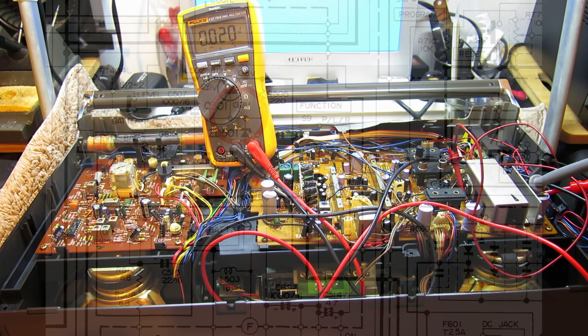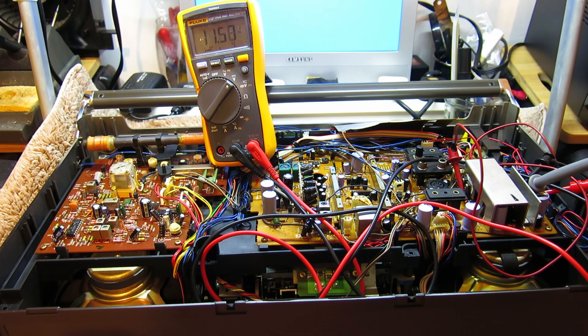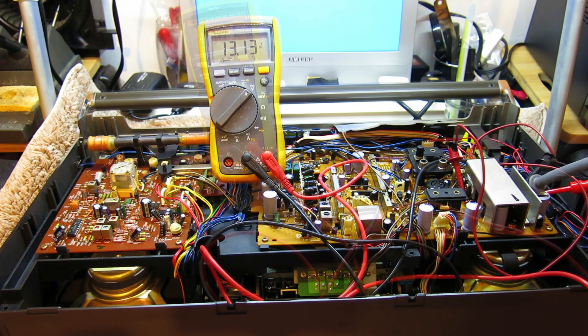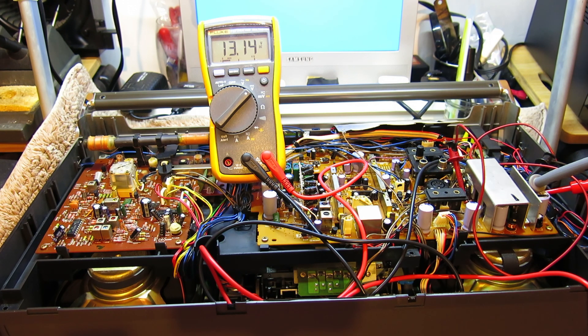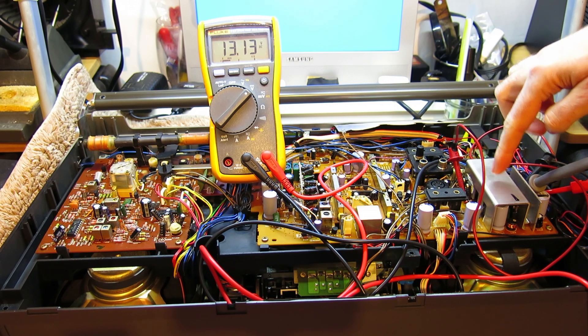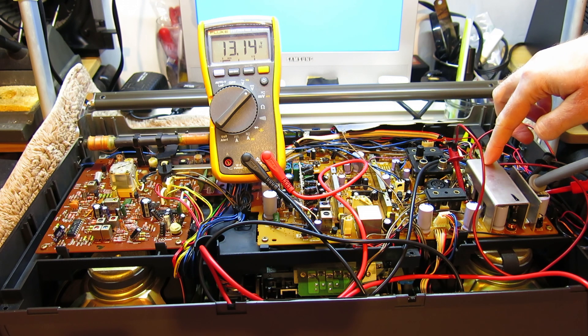We should be able to measure 13.5 volts at the base of that transistor, which comes off the zener diode. At 13.5 volts on the bench supply it's a little bit low — I tried it earlier and it was lower still, but it's like it's slowly coming up. This could be something really simple — maybe a bit of resistance somewhere, perhaps some muck in the switch. I'm going to clean out the function switch and see if that does anything. There's a possibility of a capacitor going ESR — they are right in the firing line of the heat sink underneath.